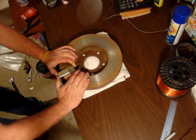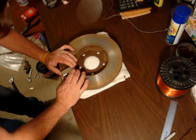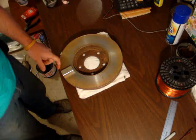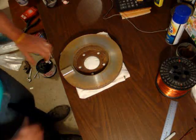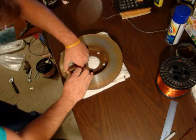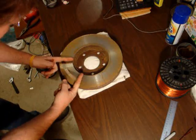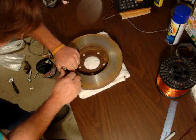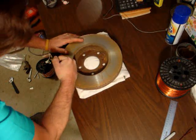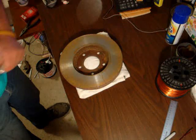When you put these magnets on, you're going to see it takes two thumbs to get it on there. Now it's not going to come this way no matter what you do — that's why that 1/8-inch lip is there. You usually want a template that holds and separates them, so when you put them down they don't try to go into each other. This is a good way to get them off: grip it really tight and roll it, and now it's off.